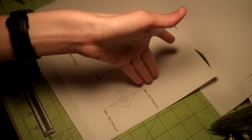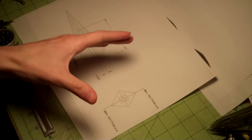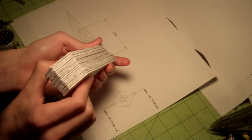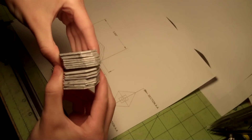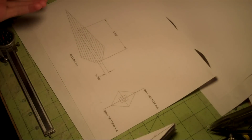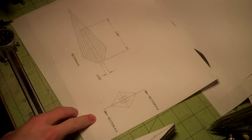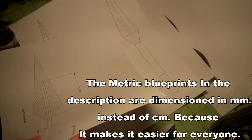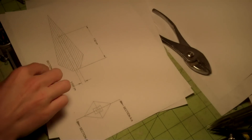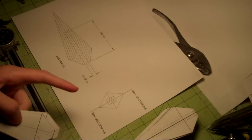This line represents a knife — you imagine that you cut along that line and the arrows are pointing in the direction of the face that you will see. So if you took a knife and cut this in half, you're going to see this area right there, which is what is showing right here. This is showing that the hole is three inches deep, and on metric that converts to 7.62 centimeters. The depth on both blueprints is indicated, along with the diameter of the drill we're going to use.